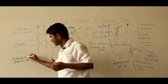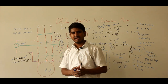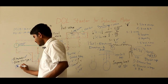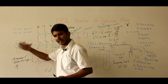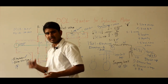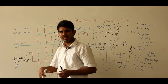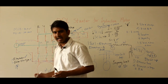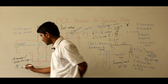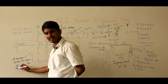The bimetallic strip is made up of two different metals whose surfaces have been welded together. If the heat is applied to the strip, it will deflect, curl up or bend, and as they are two different metals, the expansion of one metal is higher than the expansion of the other metal, and this causes deflection, or curling up. Now when this bends, the latch mechanism gets released and the motor control circuit opens when the strip gets deflected.